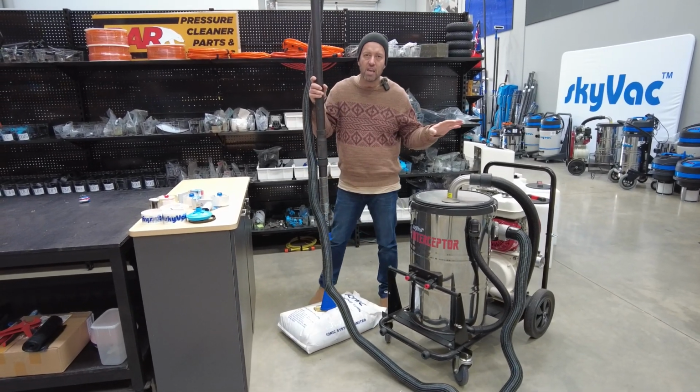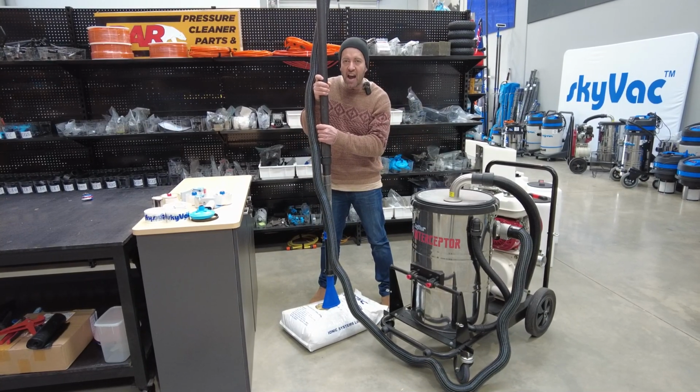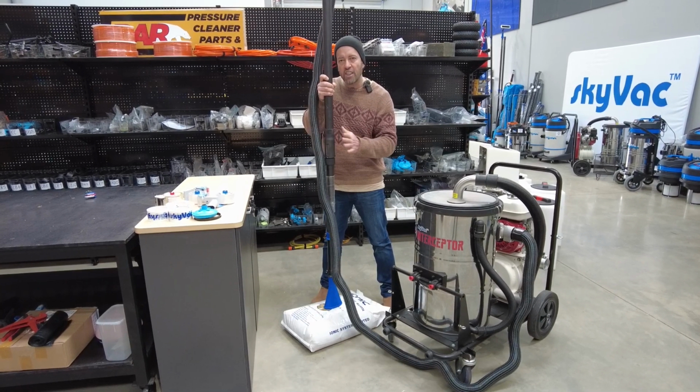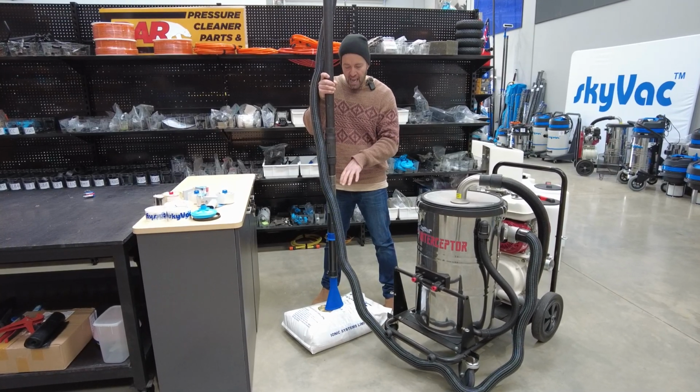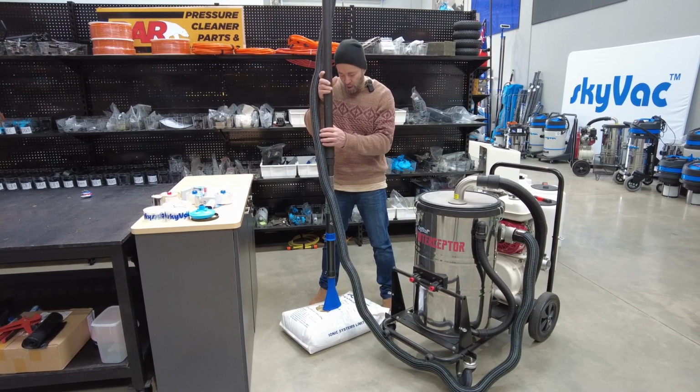Onto the system, you can hear the audible change in the vacuum. So if that's at height and I release the vacuum release, I know that I've got a blockage or I've latched onto something at height. As I said, 6, 9 or 12 meters.